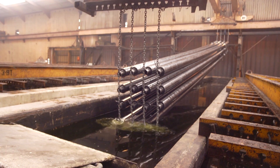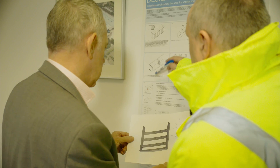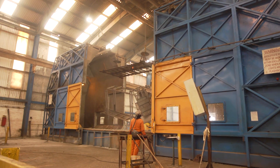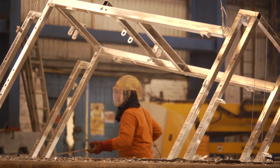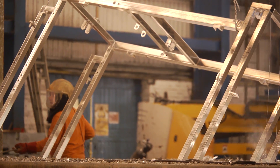The location of the venting holes will be determined by how the steel work is hung on the jigs, hence it is extremely important that you discuss your design with us. It may not always be practical to view design drawings prior to fabrication. In this instance we are more than happy to visit your fabrication shop and advise on venting requirements.